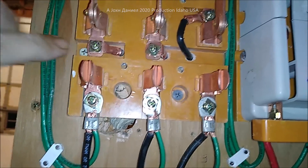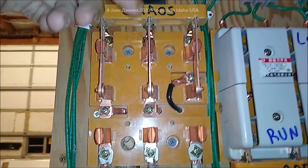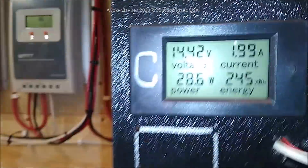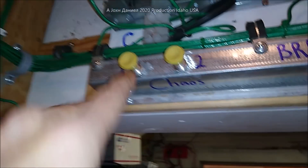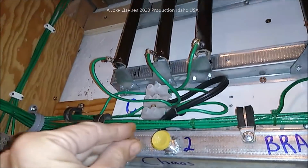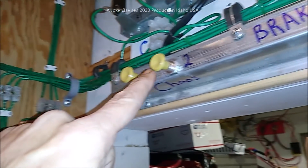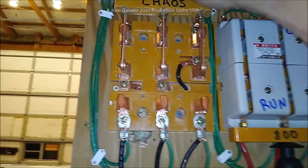You have your wires coming in from your wind turbine: one, two, three. I threw the brakes, so you can see the Chaos turbine over here putting out basically nothing. This is the resistor brake load. I don't have the switches pulled out — see, right here. If I pull them out, it puts it on brake, but it's a loaded brake — it'll tie all three of these together into the brake. Otherwise, if the wires are doing this, they go to the brakes and make a dead short — that's if there's no wind and you want to park your turbine.